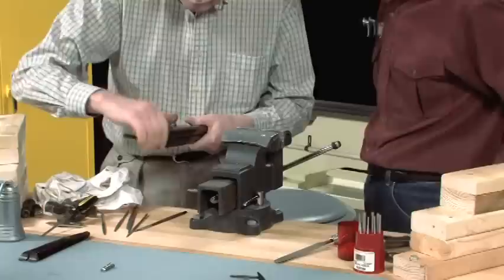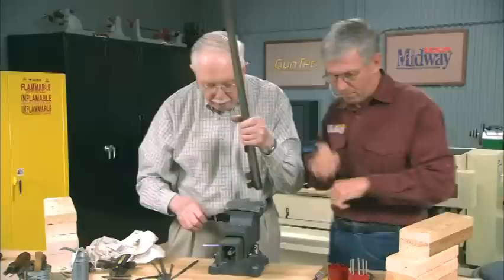Now, take that off. Take the action off and examine the hook. You'll see that I've got two shiny marks there where the smoke black has been removed by the new pin. I'm going to take out the removed metal at these two points in the hook, and keep doing that till I get a good bearing inside the hook, and then I'll finish off the job by taking metal off the face of the action.